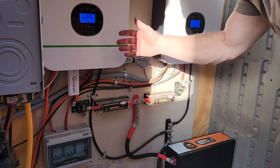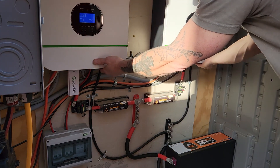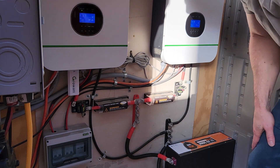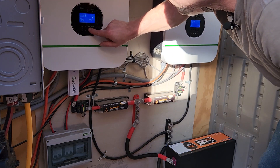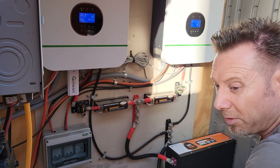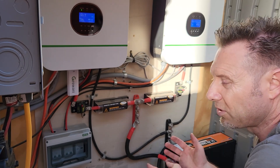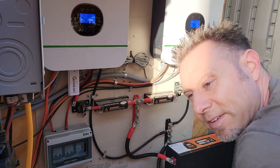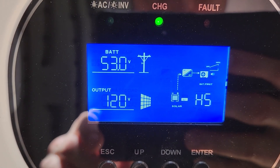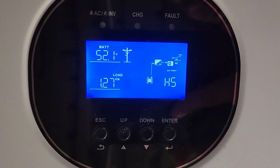With those on, batteries are hooked up, everything's good. Let's take a look at what the voltage is - I'm going to turn on the system. Battery is at 52.4 to 52.5 volts. Tomorrow I'm going to charge the battery all the way up and then do a full discharge and check capacity to see what we get. So I'm running the capacity test now. After charging the battery, its resting voltage was 53.1 volts. More than likely one of the cells reached the over-voltage protection and charging was shut off - over time this will normalize.